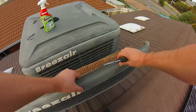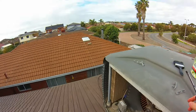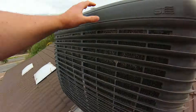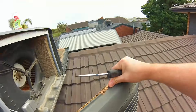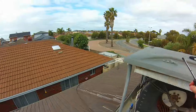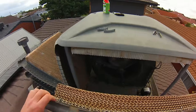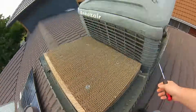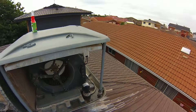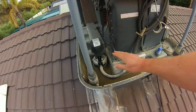You'll also want some cleaning products like Pinoclean or disinfectant — any multi-purpose cleaner will do to get rid of germs in the unit. Now we're just removing the side panels. It's really easy — just jam a screwdriver in the top, prise it out and it pops right out. Bear in mind that the honeycomb cardboard linings are very fragile and can crack, so stack them gently.